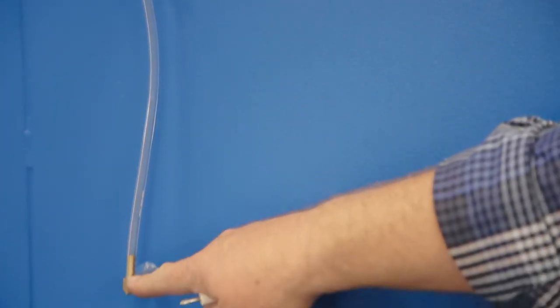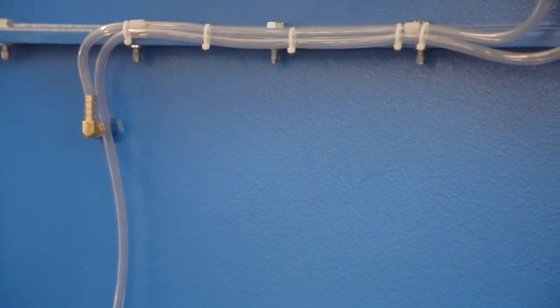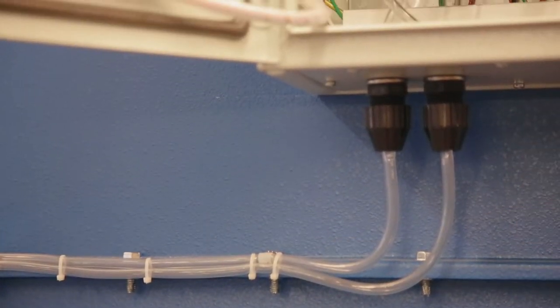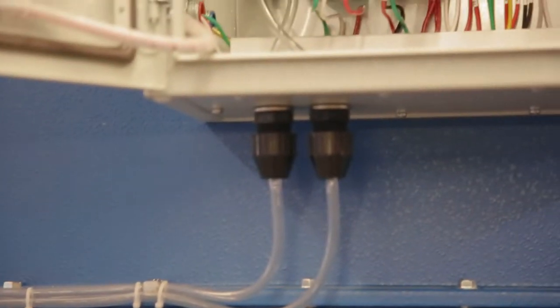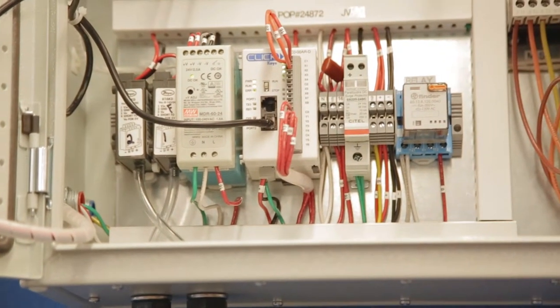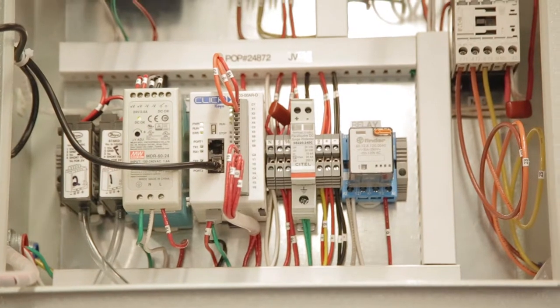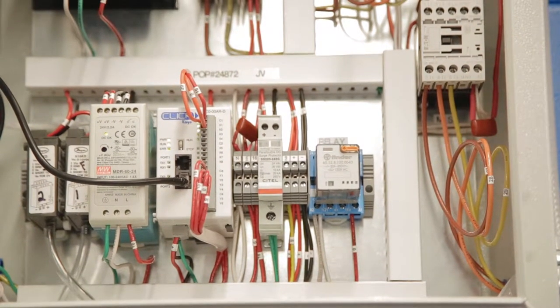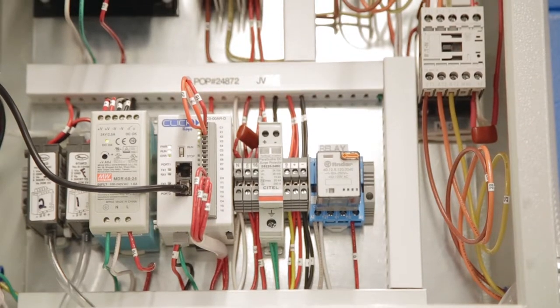This pressure connection is below the impingers. It's actually the scrub pressure, or the raw scrub pressure. If it were a ducted unit, there'd be a third switch and it would connect at the front of the unit, just like all of our other ducted units do. The PLC will do the math and calculate the difference between the scrub pressures and the filter pressures, and the gauges will adjust accordingly.